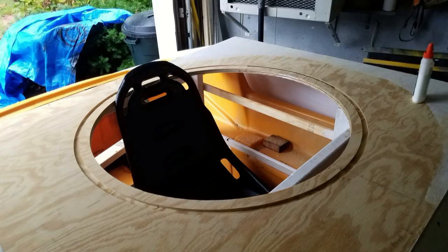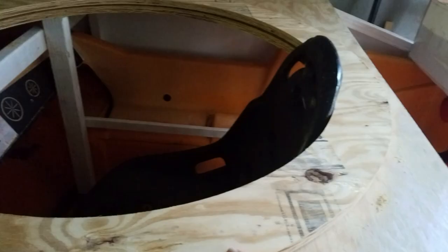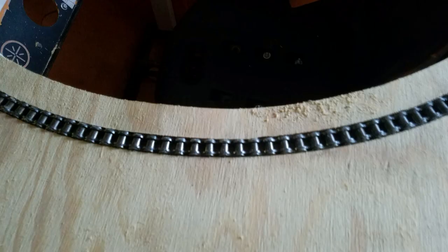The rail that was inserted into the turret ring would ride over the roller chain which was inserted into the hull deck, acting as a huge bearing. I had to dremel the inboard side of each link in order to get the chain to curve this way.